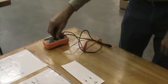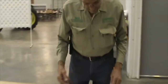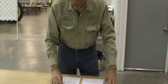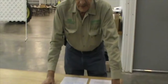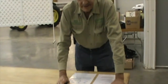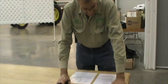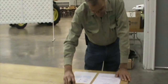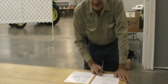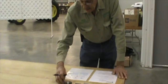For our next component, this is called a relief valve. The first question: it can only be used on John Deere tractors. That's incorrect. The relief valve is used on any and all makes, even internationally, within hydraulic systems. If this valve were to stick open, the second question is will the pressure increase? That is incorrect.